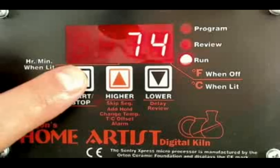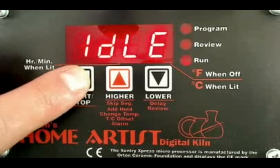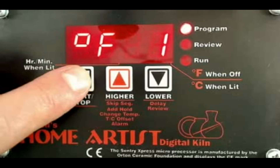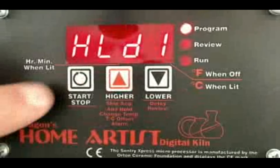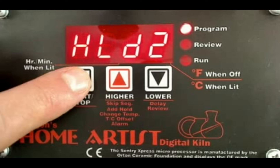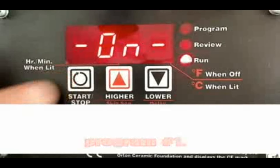If you want to review what you've done, you can hit that enter button, which will stop it. It's 75 degrees in the kiln right now. I can hit the start-stop button to go through exactly what's programmed in there. Hitting it again takes it back to idle. Hit it again — it goes to program number one. Ramp one is set at full speed up to 1730 degrees. Hit that button again — it's got a 10-minute hold. At any point, if I saw an error I wanted to change, I could use the up-down arrows. Ramp two is full speed down to 1680 degrees. We've got a 3-hour and 52-minute hold programmed in. Ramp three is at zero, because that was the end of the program. Hit it two more times and the kiln is back to on.